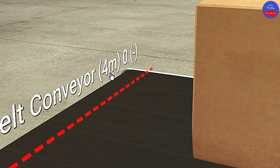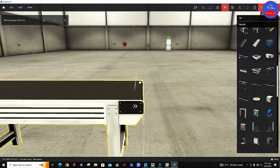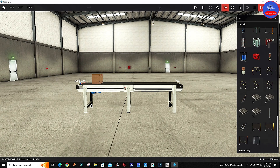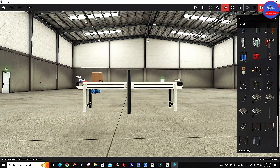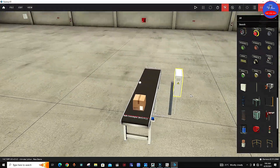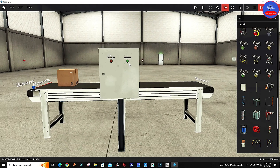We can see that we have conveyor plus and conveyor minus. The plus will be the forward contactor and the minus will be the reverse contactor. Then we move the box a bit in front. Conveyor plus is forward and conveyor minus is reverse. Now we are going to select the start and stop push buttons. We pick our pillar, take our panel, and mount the panel on the pillar. Now we are going to select the start and stop buttons, so we close this and come to File > Drivers or F4.